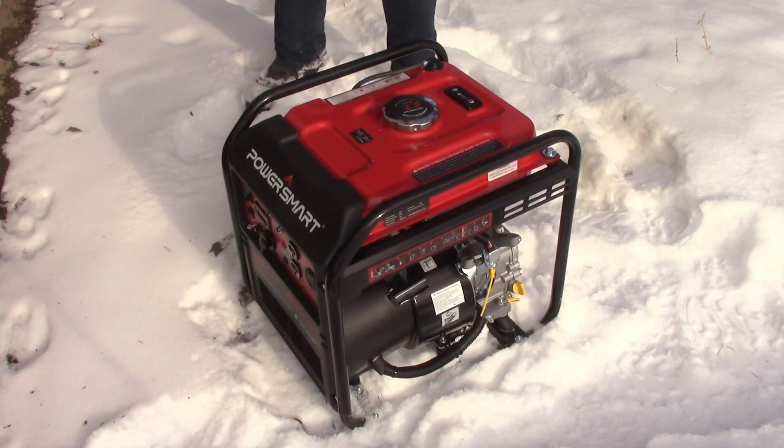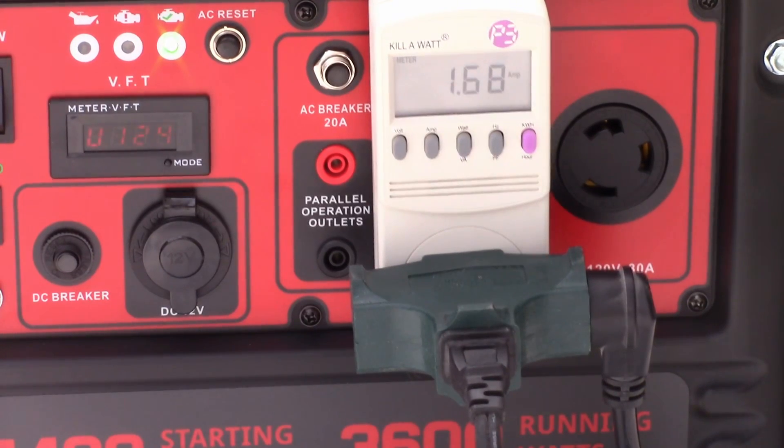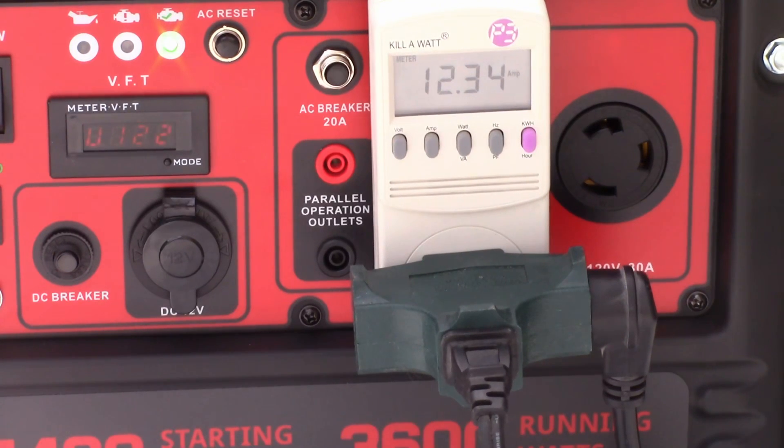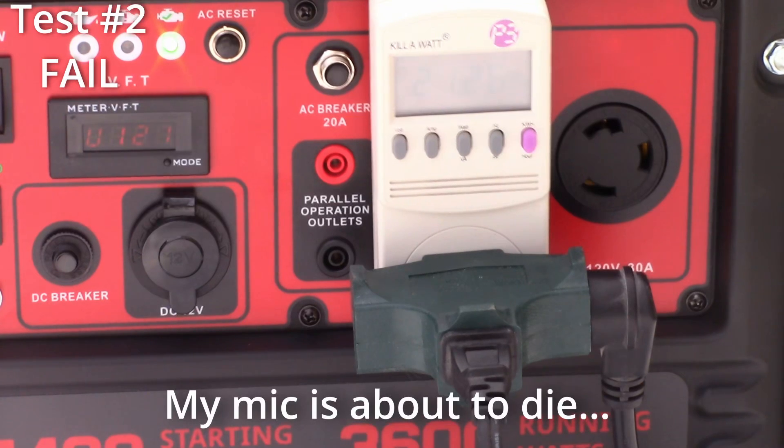It's not running smoothly. Let's plug a load into it. Space heater one is on — we're at 12.4 amps. Let's try the second space heater at half power. The kilowatt meter does not like that many amps going through it, it's flickering. We're at 17 amps sustained. Go for gold — high power. 20.74, 20.9, 21 amps — 21 amps sustained.